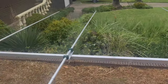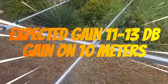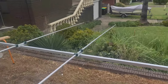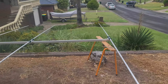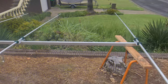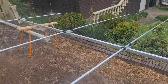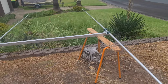So, we'll see how we go. They state between 11 to 13 or 14 dB gain, so we'll see how we go. As you can see, she's coming along — not too much more to go. Then we'll have a go and see if we can tune it in and match some SWR. It's a 4-element for 10 metres, but it can be adjusted to suit 11 metres as well. The build's based on 28.500.